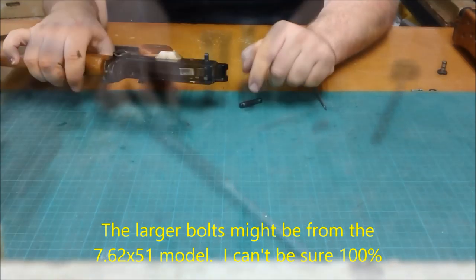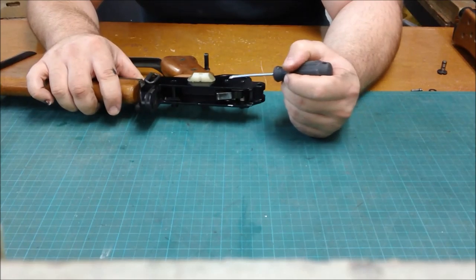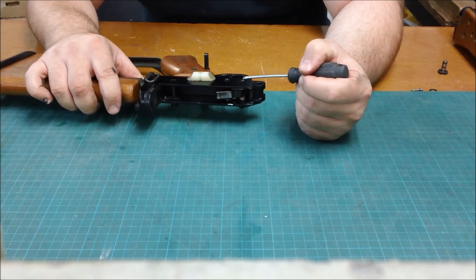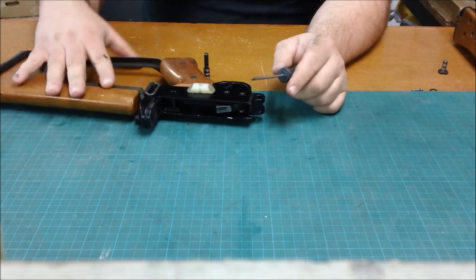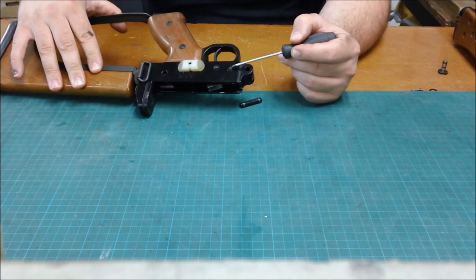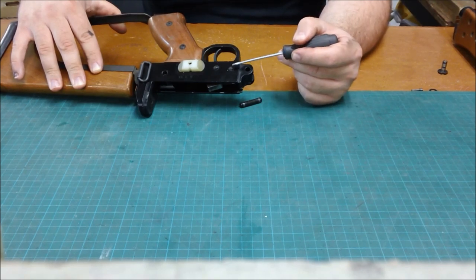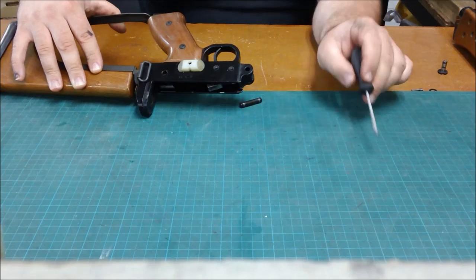Another one of those. The lower receiver here, you notice the trigger group is very similar to that of an M1 carbine. But one thing you notice is that the sear pins for the trigger and hammer are very, very close together. And he felt the closer you kept these two sear pins, the more robust, the more durable the trigger would actually be.